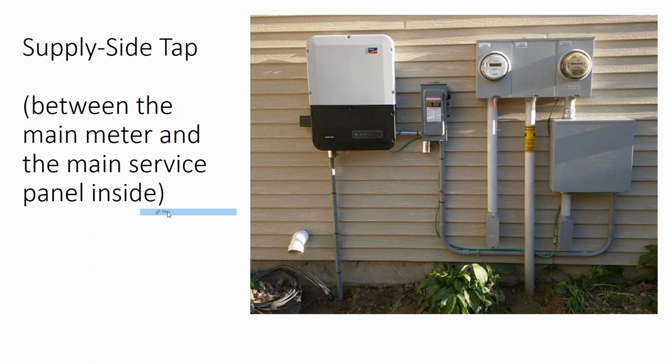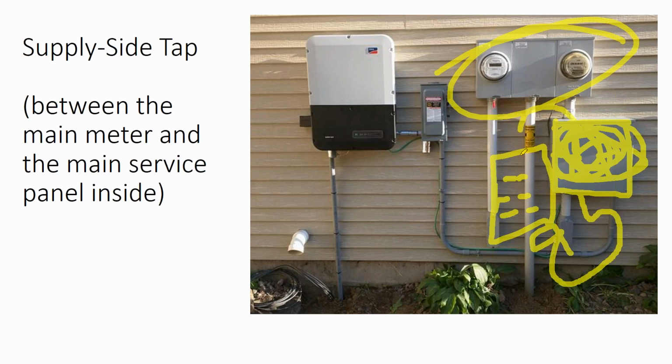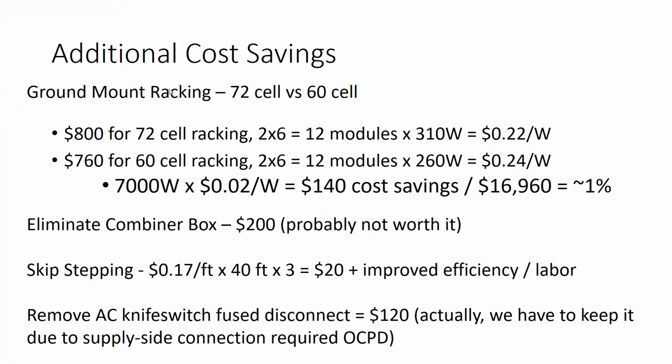And so where electrical design is going is that there's actually going to be two service panels for a home. There's going to be an energy distribution panel, and maybe this is also a transfer switch that can take the home on and off the grid. And after you come out of the energy distribution panel, that's what you would land on what we would consider to be our main distribution panel or main service panel. And that way you can always have as much power as you need to feed the panel. Most residential panels are not using 100% of their capacity at any time. They might be using 10% of their capacity at any time. So a solar array that produces twice as much power for 1/3 of the day can do damage onto the bill.